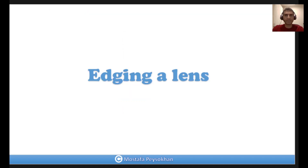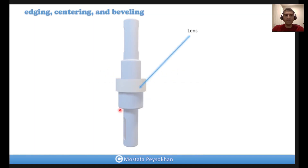As explained before, first we align the optical axis of the lens with the mechanical axis of the lens using the two cups and the rotational spindle. We use a laser to get reflection from the top surface and rotate the two cups and the lens together. After that, we can say the mechanical axis of the spindle is aligned with the optical axis of the lens.